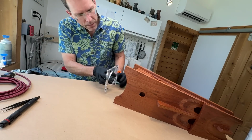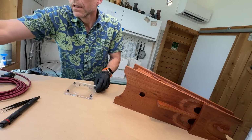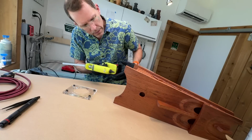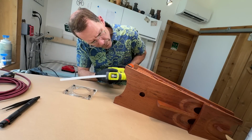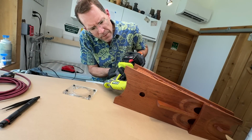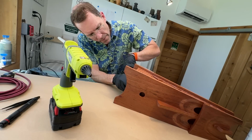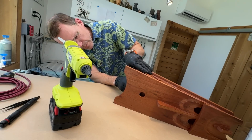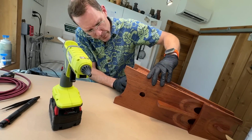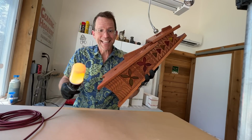I put the acrylic light bulb mounting fixture in with hot glue because it's a somewhat permanent glue. If anyone ever really needs to get into this lamp to do any repair or maintenance or anything like that, you can usually pry out something glued in with hot glue if you are careful and put some time into doing it without damaging anything. It's much less permanent than super glue or other wood glues. It's happening.